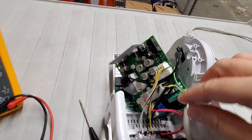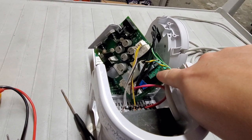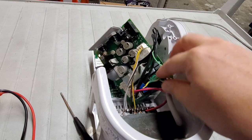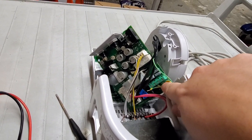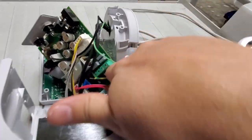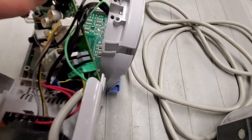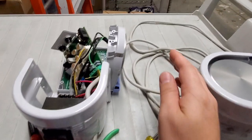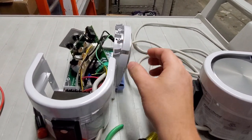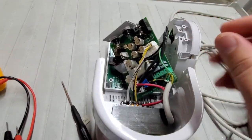Here I've got the inside of the Fisher & Paykel. You can see that the AC mains comes in here. There is a ground bus — this main ground lead right here comes in and connects to that second screw down right there. And then this first one, this little skinny green one right there, goes to the platter itself. So when you're doing electrical safety, you're going from the ground pin right here — basically that common bus should be close to zero ohms to the platter. And we're currently getting multiple ohms worth of resistance.